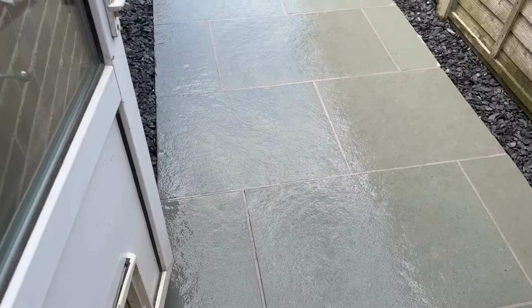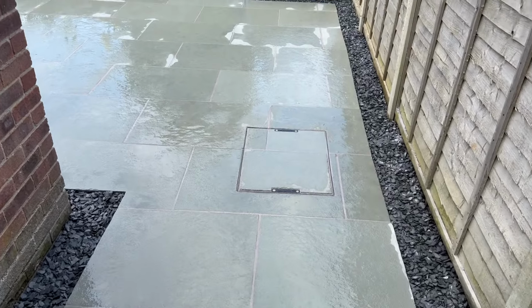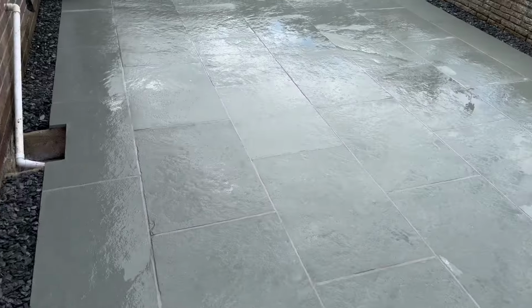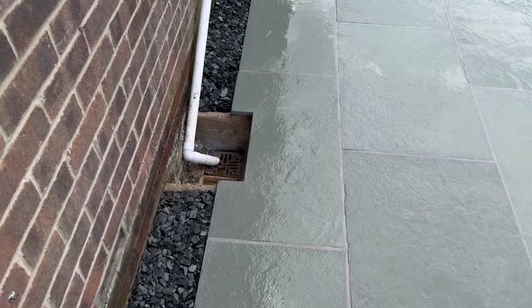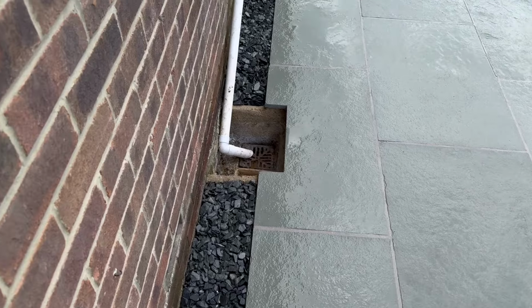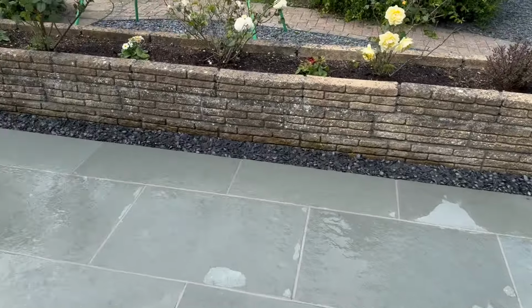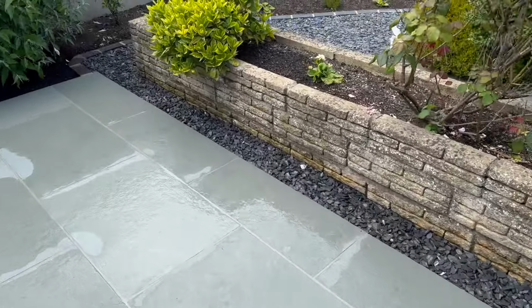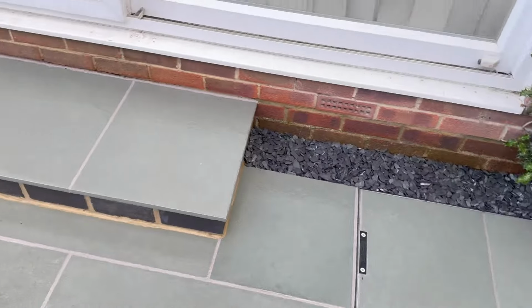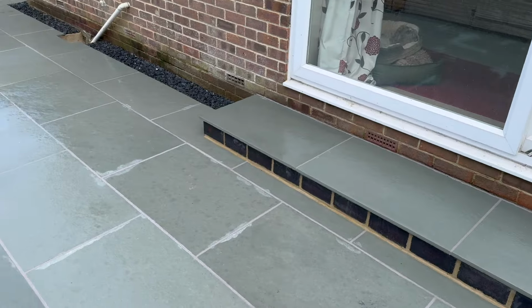So now as we come out the back door, we have all the new paving, we've got all the blue slate chippings around the side acting as a water runoff and decorative feature. We've got the inset manhole covers. We did the drainage section there, giving that some concrete walls to retain all these chippings. The main drainage run across here with the land drain pipe, a good 2 feet down. Redressed all the soil here. Is the other manhole cover. Got the new steps for the customer when they come out these patio doors.